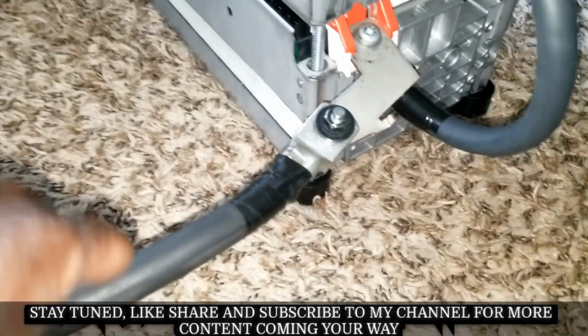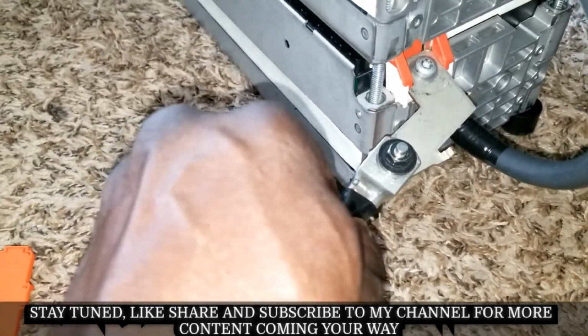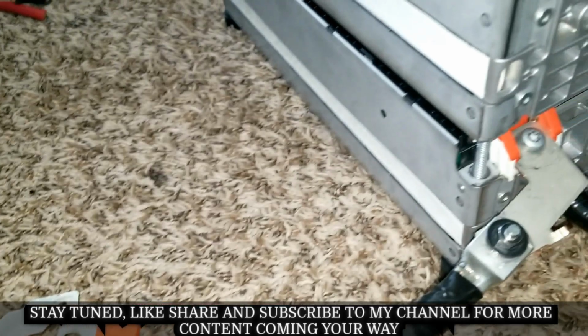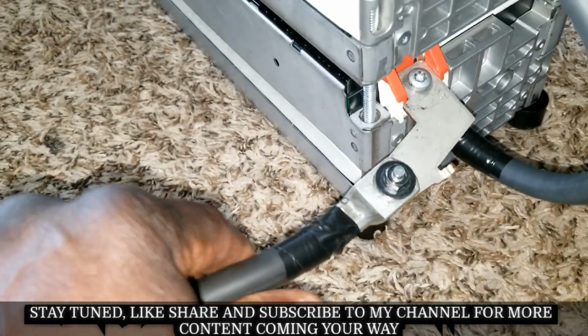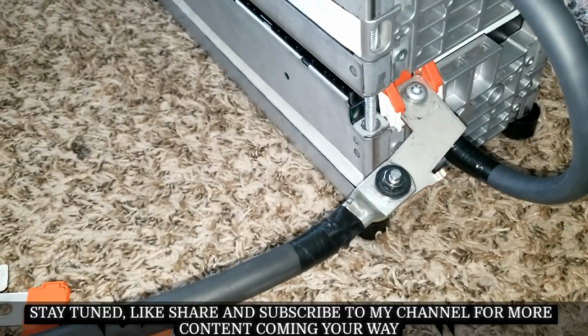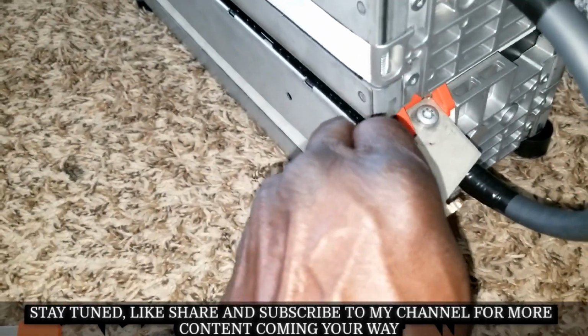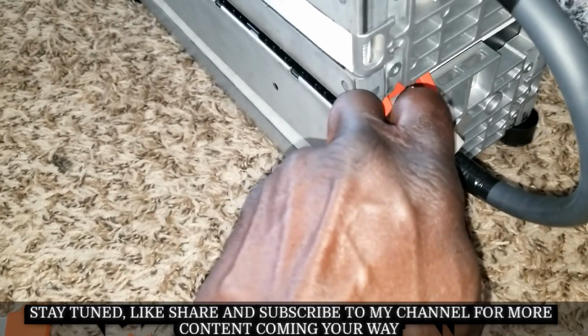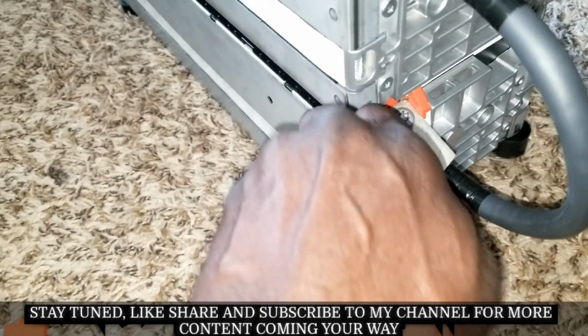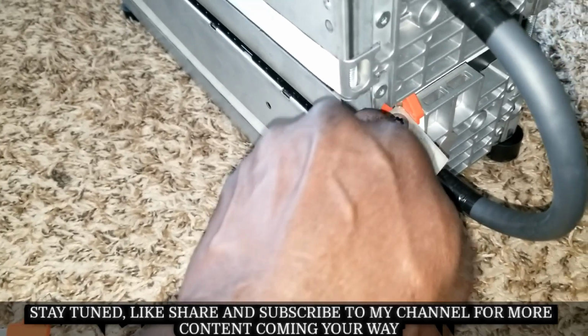Don't forget to mark your wire. So it's going to be a negative coming here. Where it's going to be attaching the other end here is going to be positive. You have to put a red tape right here, or shrink wrap, or heat shrink, sorry. So this way, perfect. So I'm gonna go that route, and I just decided to test it, and it works, and it blends right with the color of the batteries.